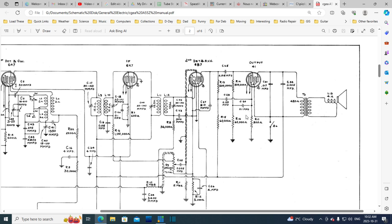Perhaps what I can do is a temporary installation here. I can put the capacitor in and take it out, and we'll see what the difference is in the operation of the radio. My expectation is it would get louder with the capacitor in. But it's pretty loud as it is. Okay, I think I'm going to do this experiment. I'm going to find out where the connection points are for this. One is the cathode, and the other one is the bottom of this resistor, R14. And we're going to hook up a capacitor in there somehow and then experiment a bit and see what happens.